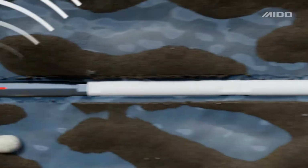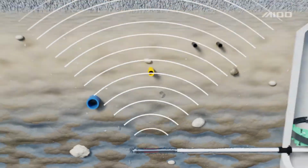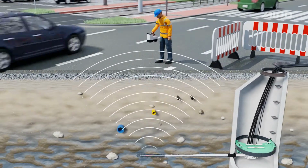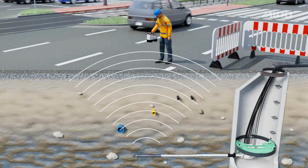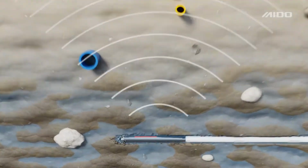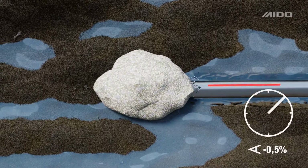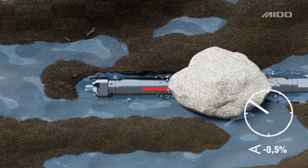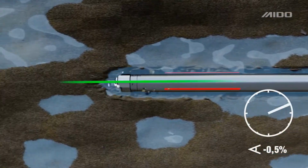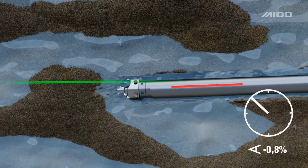The precise location system combined with the innovative drilling head positioning system allows the installation to be performed with the highest possible accuracy, reaching 0.2%. In most technologies and machines intended for horizontal drilling, single drives working with single heads are used. Such solutions do not allow for precise control of the drilling direction, which often results in an unacceptable change of the required gravity flow pipe.